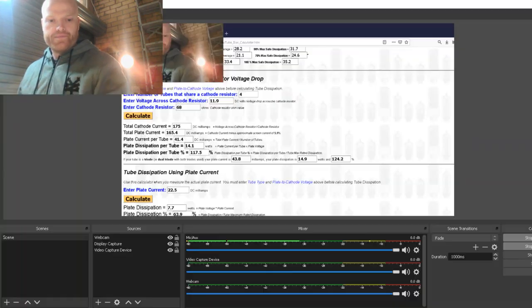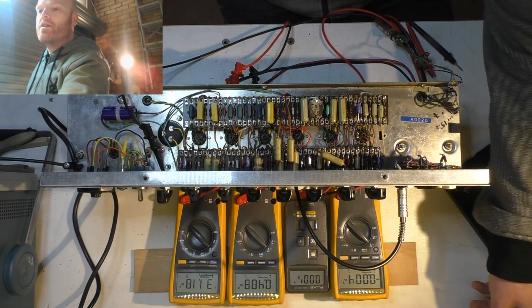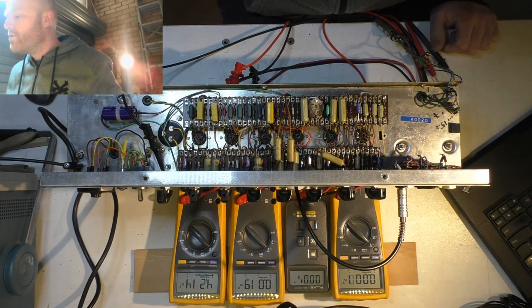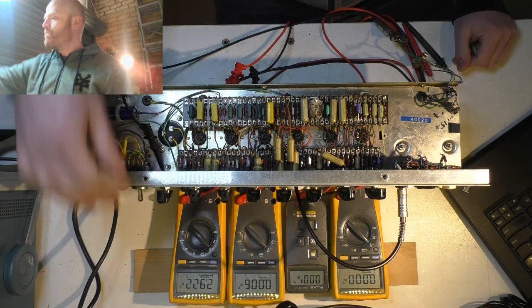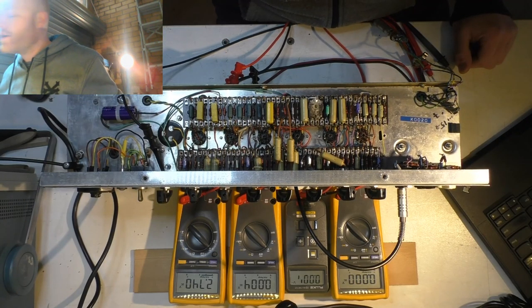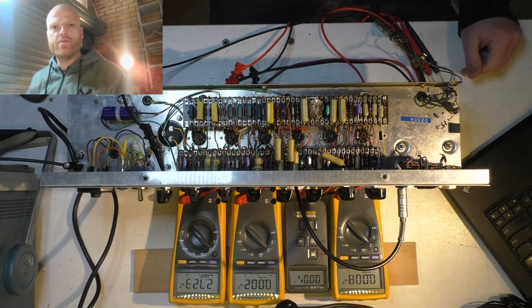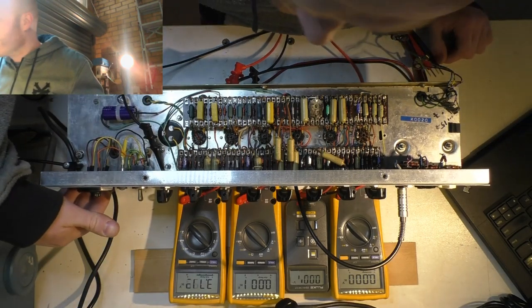So let's do that. Power it down, let caps drain, turn off the mains, unplug it. We're already down to 4 volts as the caps discharge, because the valves are still hot, they're still conducting. So the valves themselves are actually draining the caps there, more or less. You can put a bleeder resistor over them as well, just to be safe. So is anyone watching? One person, fully sick. All right, so we're drained. It's rising back up again as the caps recover, but no biggie.